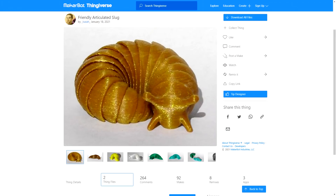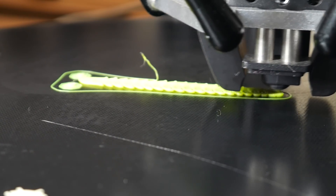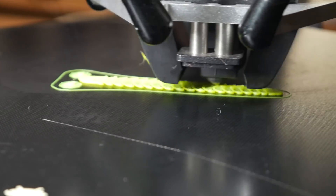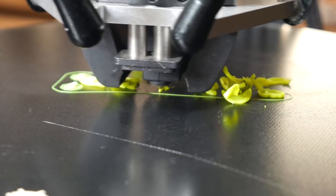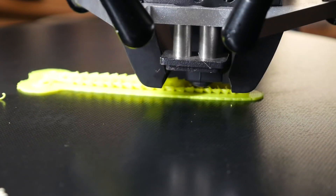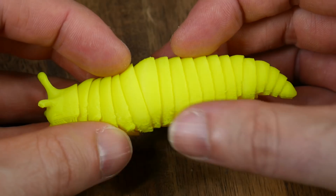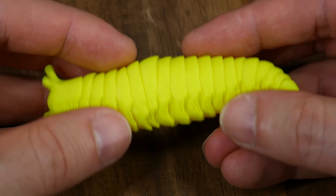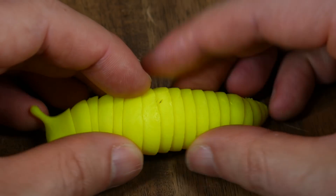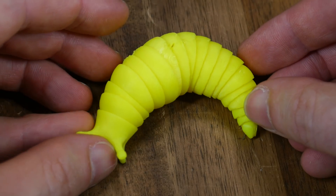For testing ABS, I selected a friendly articulated slug. The reason I picked it was to test the first layer adhesion for ABS with a ceramic coated glass bed, and consistent with my previous experience with these beds, ABS doesn't stick as well as PLA. To combat this, I re-sliced the slug using a raft, and the print completed successfully, so I would say ABS is possible but not optimal. The finished print has a few parts where it could have done with some more cooling, but apart from that it's fairly sound, with the slug indeed articulating in a friendly way.